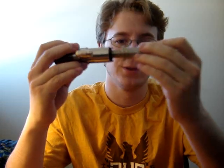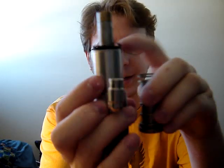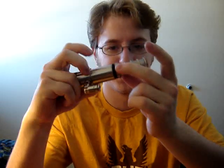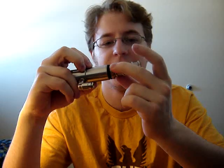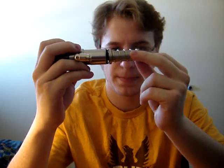When this thing fires, it blows forward, fires a power pulse, comes back, and then it hits this. This is a wave spring, and what it basically does is induce bolt stick. So the bolt is stuck like this. The chamber won't fill because the trigger can't return all the way, and the bolt is pushed open.